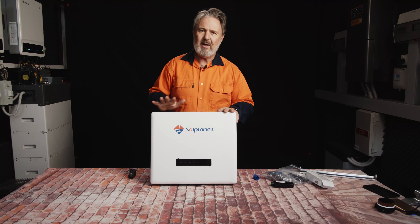This very small, compact, lightweight, easy-to-install, three-phase, five-kilowatt inverter — the beauty of three phase is the balancing it does for you. It balances across all three phases, so you're not getting a voltage imbalance on your phases because you're spreading generation across all three evenly rather than injecting it all onto just one phase. That's a nice thing. Often when having multiple inverters, you really do want to spread that across all three phases. You could have three of these, for instance, and in most jurisdictions still be within the limits for a domestic installation. I'll put all the specs up on screen so you can see more.